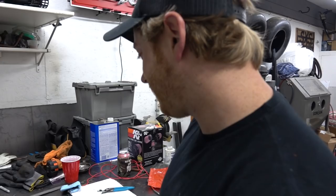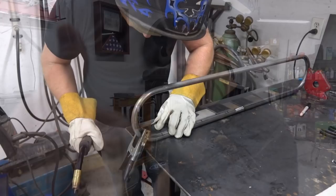Doug has put more work into figuring out the mounting solution. We talked about welding tabs to maintain all the adjustability. He went out and figured out the spacing to keep the light centered vertically in the hoop, and what the spacing between lights is going to be, then marked it all out. Now we just got to weld the tabs in, then mark each tab the correct distance from the face of the hoop so each light is flush with the front or maybe recessed slightly. Drill the holes, mount them in, and move on to mounting it on the Razor.